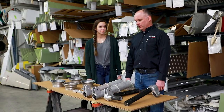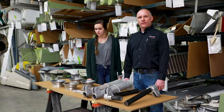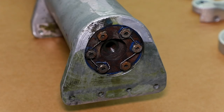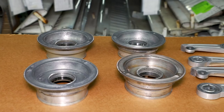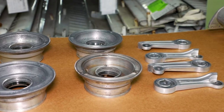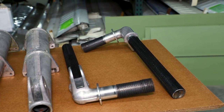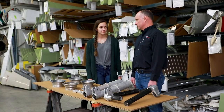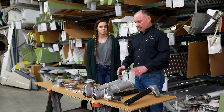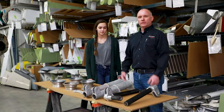This past week I also completely dismantled the landing gear and stripped the paint off all the components. We're going to overhaul the main cylinders — we bought refurb kits from McFarland. Everything will go for paint; I'm thinking silver on all the landing gear components, assembled with all brand new hardware, brand new tires and tubes. That should give us a sharp undercarriage. We'll do the nose gear later when we change out the engine mount, and then the landing gear will be ready to bolt back onto the wings before we put the wings on the aircraft.